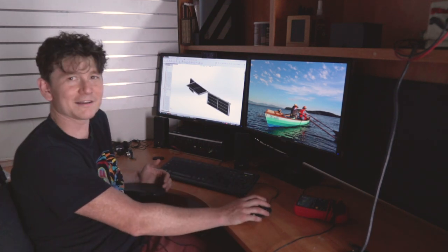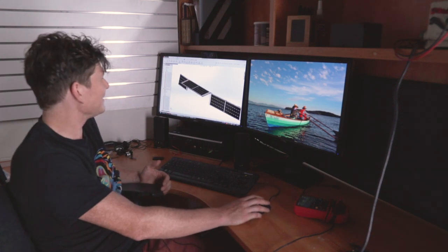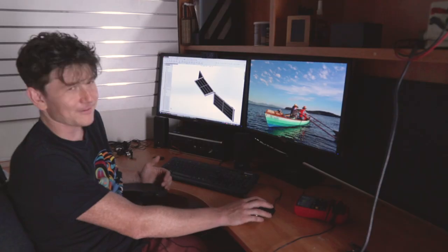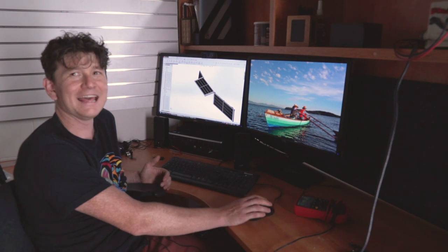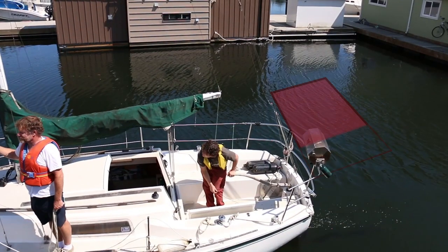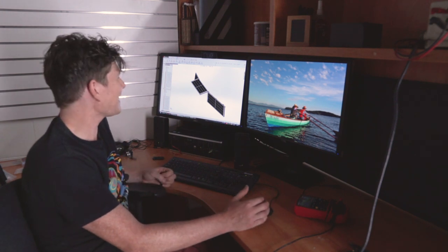With the length I have, I'm able to fit five of these 100-watt panels — giving me 500 watts down one side of the boat. We put another 500 watts of panels on the other side, and then that leaves the whole back cockpit area to have a more conventional rooftop panel. With this approach I should be able to get 1500 watts of nominal solar.